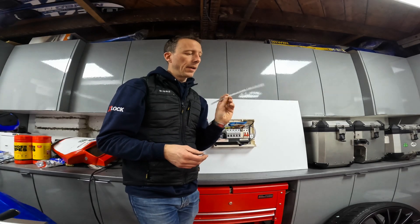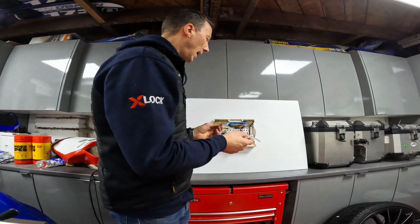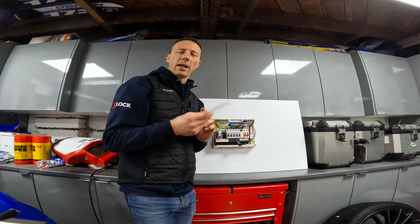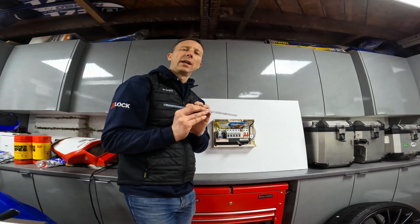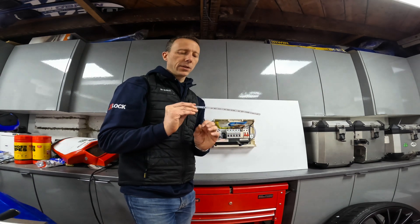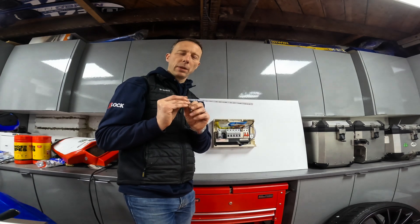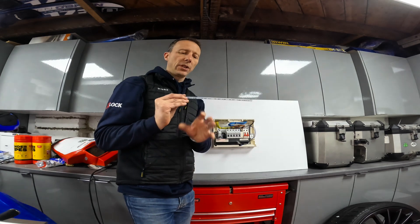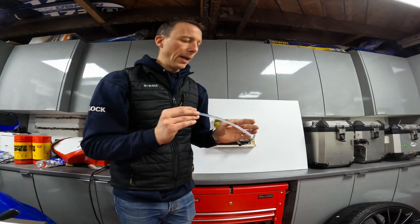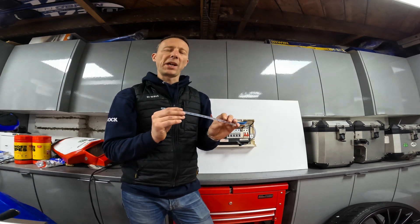They're so cheap. This one I think is the medium sized, about £25, and they can be fitted in about half an hour. They will put the fire out as it starts — this is a thermoplastic tube, and as the fire starts inside the consumer unit it will melt at the hottest point, discharge the liquid onto the fire, and put it out. They are designed for the size of the consumer unit to completely extinguish the fire.